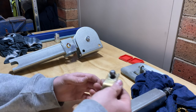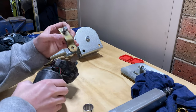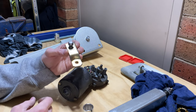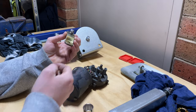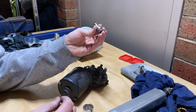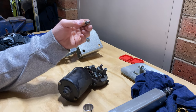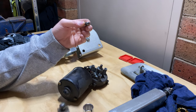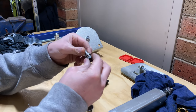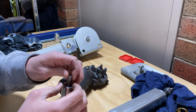And then what I've done was I took the arm off the motor that was on the shaft and cut that into basically a hexagon sort of shape. And then I took an old one of these motors, smashed the casing up around the side and cut the shaft off and made this little blank here. So basically what that's done is given me, inside the chuck of the drill, I was able to hook up this little pentagon sort of thing, and then bolt that in and turn that down to the right size by tightening the nut. So if you see that inside, it's a nice snug fit now.